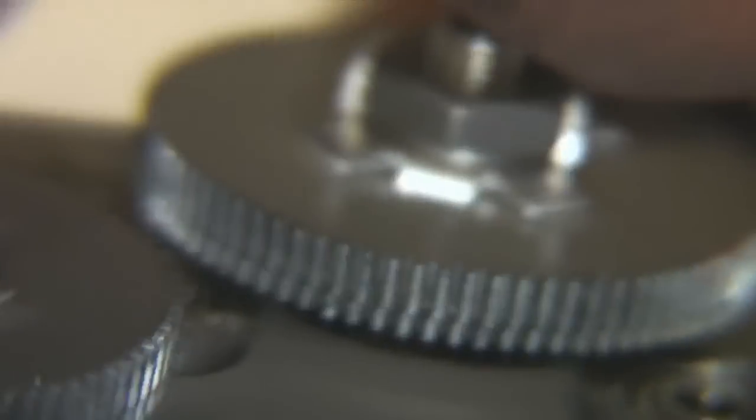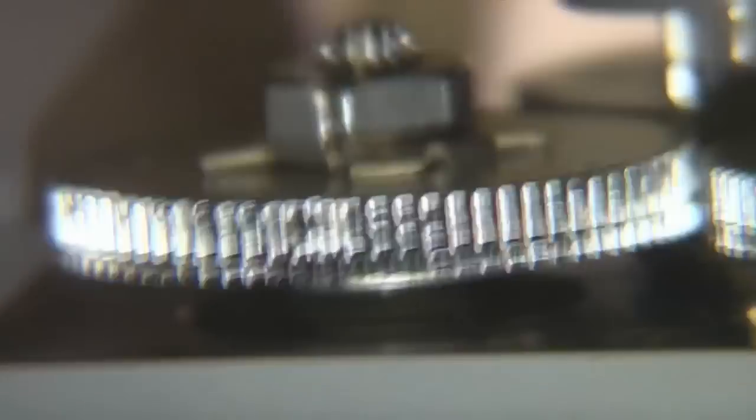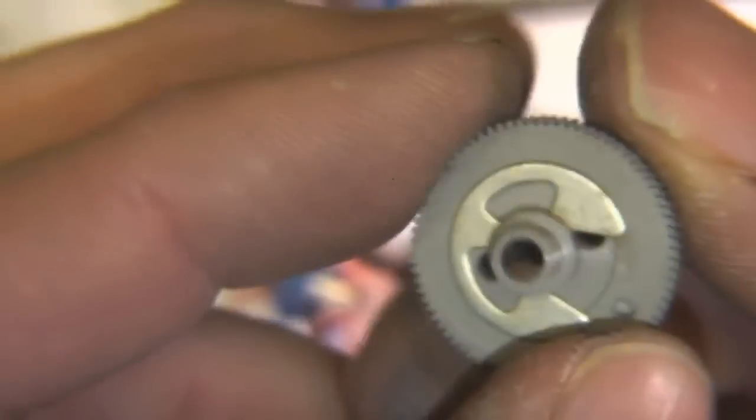Interesting, there didn't seem to be anything to stop backlash on the big gears that coupled that big part of the main section, which was a little bit surprising. You can actually feel notable backlash, but all the gears in this mechanism seem to have these anti-backlash gear wheels on them. It's also got lock nuts to prevent these nuts coming undone. These washers go down there, then they get bent up the side of the nut to prevent the nut coming loose. Here's the anti-backlash gearing.